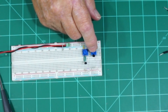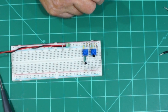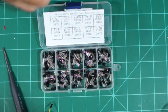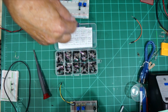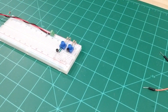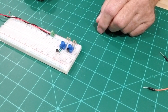In the previous video I mentioned the S8050 transistor; here I have the 2N2222 transistor. Most transistors are close to the voltages we need here. We're using an NPN transistor — the 2N2222 is an NPN, and the 3904 is another common one we could also use, but we're using the S8050 on this circuit. We use NPN because we're going from positive and having the emitter on the negative side of the circuit. With a PNP transistor it's the opposite — the emitter is on the positive end.